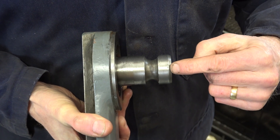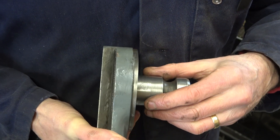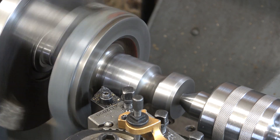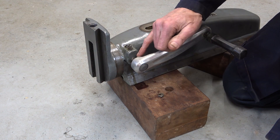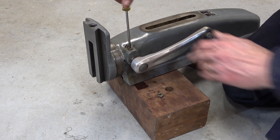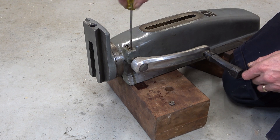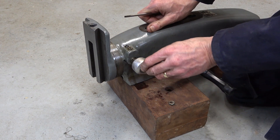When I put this in the head, it's fine up to the part I've machined, but when it's pushed in far enough to engage, as I turn it it goes tight and loose, tight and loose — so I'm going to have to finish the machining right into there. This screwed peg goes into a groove in the locking spindle and stops it sliding side to side, but it must have been snapped off at some point because the nut is supposed to go on it — I'll have to make another one. But if I unlock this, the swivel moves freely now. Locked — that's done.